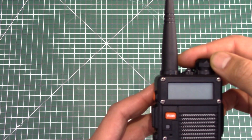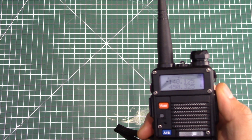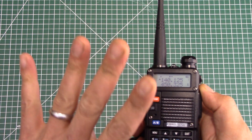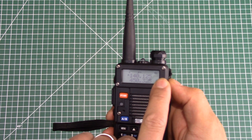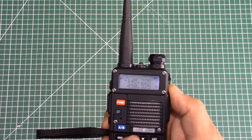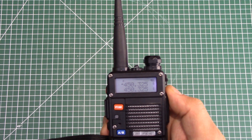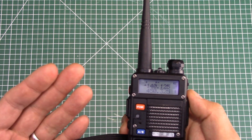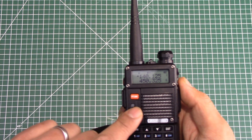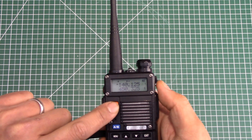So in order to do this, let's pick up the radio and turn it on. I booted up into channel mode. We've got to be in frequency mode in order to program it, and what's important is you have to program into an empty slot. Notice I've already got four channels stored on the radio. In the upper right corner, I'm on the first stored channel, which is channel one. Pushing up: channel two, channel three, and apparently the fourth channel I decided to store in slot number six. So I've got four channels stored on channels one, two, three, and six. So let's switch over to frequency mode so I can punch in the frequency of another station I want to save. I'm going to push VFO/MR to get into frequency mode.